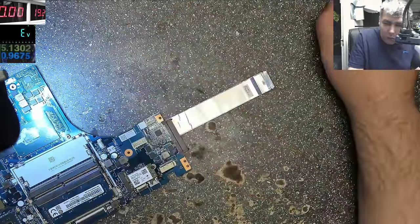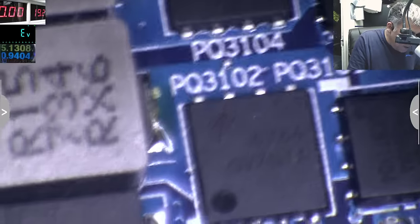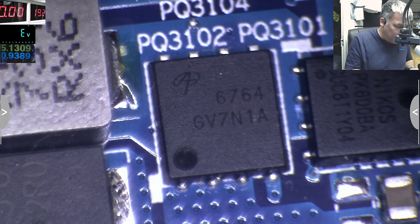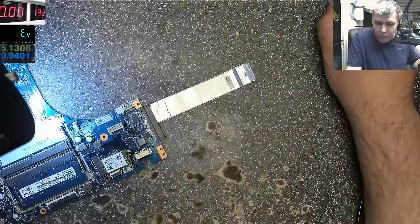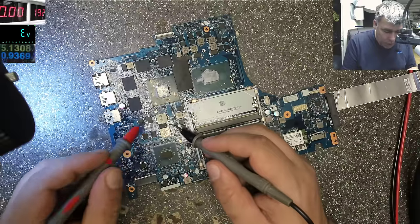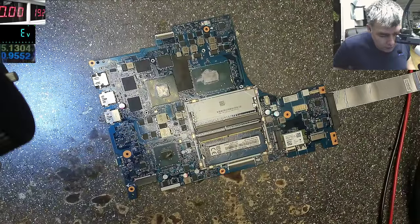The ones from here are not dual. You know the processor ones? No, they are not. They are normal. You can see, it's very easy to see because it's only one gate. One gate here. Here, you have one gate. Okay? But you'll probably make the same mistake as with the processor. You go and check this electrolytic capacitor, plus, minus, and you see, okay, I have 2 ohms. So we have a short. No, you don't have a short. That's normal.